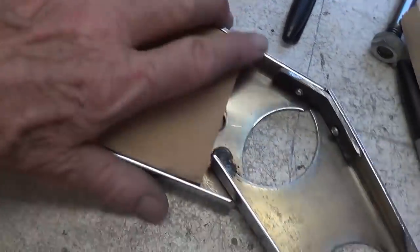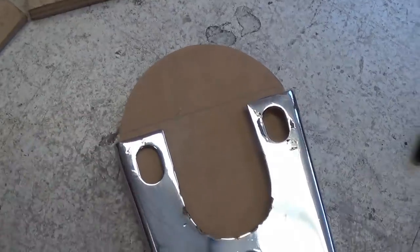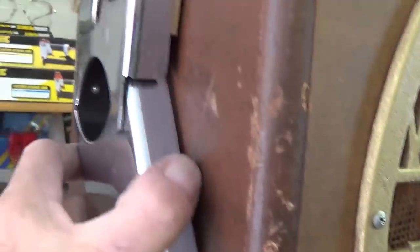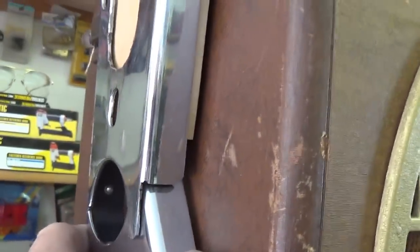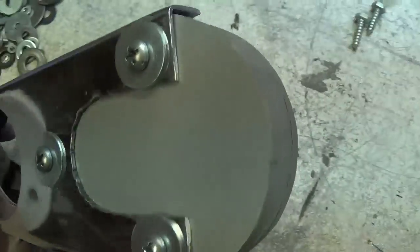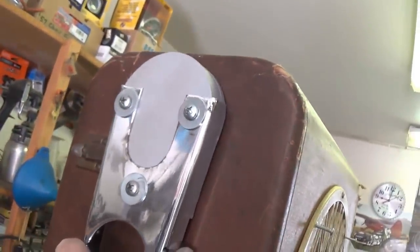Now to do our shoulder for the arm, I cut out a piece of wood that fits the inside of the arm and comes up arched in shoulder fashion. Since we want the arm to be spaced away from the body of the speaker cabinet to avoid rattles and buzzes, I'll have to make a shim about a quarter inch thick to give a little bit of clearance between the arm and the speaker cabinet. The 3/4 inch wide shoulder plus the quarter inch shim are finished and ready to be installed. The shoulder piece is painted silver to look sort of like aluminum, and then securely screwed to the arm — giving sufficient clearance between the arm and the cabinet. It looks rather shoulder-like.